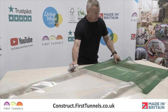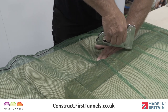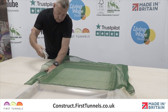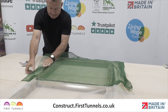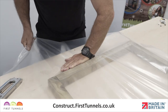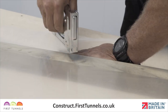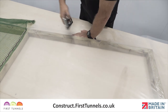Continuing with the net panel, pull it tight to remove any wrinkles and secure it to the top cross piece. Now work down one side and secure it to one upright. Pull it tight across the width and secure to the opposite upright. The polythene panel is secured in the same way. Pull it tight to the bottom of the door and secure it to the bottom cross piece. Secure it to one upright, then pull the polythene panel tight across the width ensuring there are no wrinkles or creases, and secure with a staple gun.